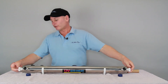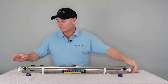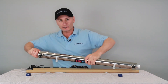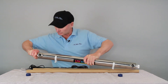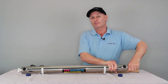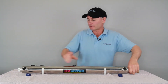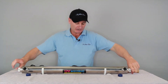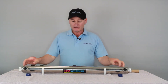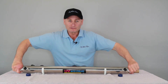Now what you're going to do with these is tighten them up as tight as you can by hand. The two nuts, either end — tighten them as tight as you can get by hand. You've got to seal it, so you've got to do it as tight as you can by hand. If you start putting spanners and tools on, there's every chance you're going to crack or break something. It's got to be done up by hand because it's got to be tight enough to seal on that O-ring. So at this point we've inserted the glass through the centre, put the O-rings on, and locked it up.